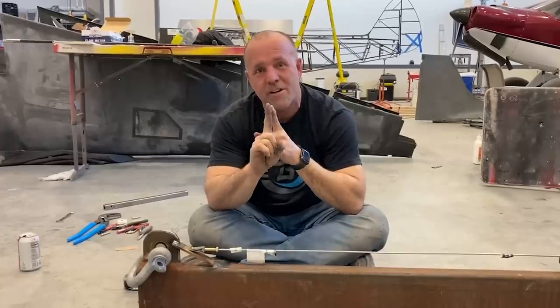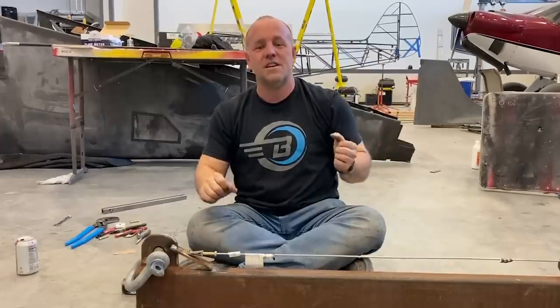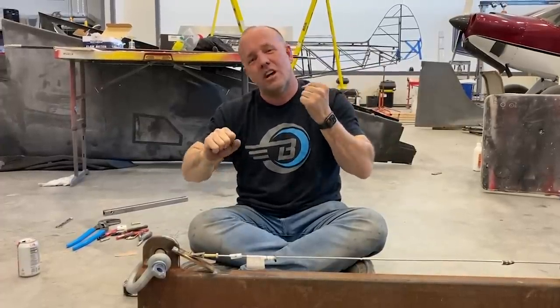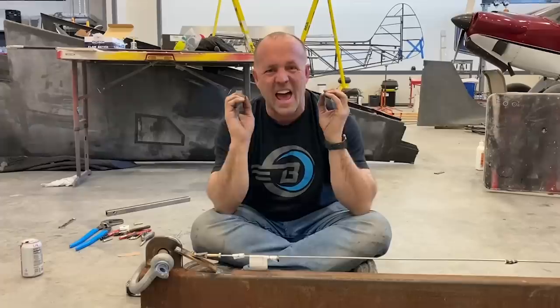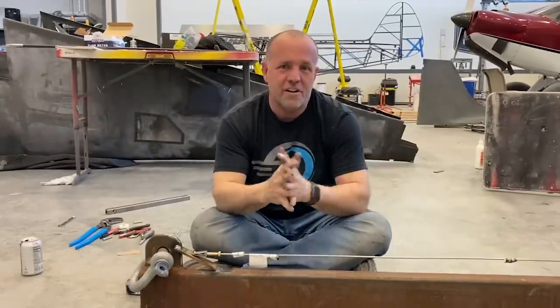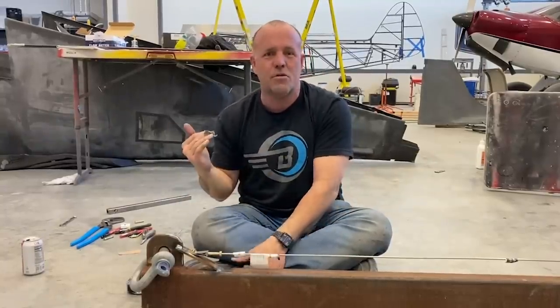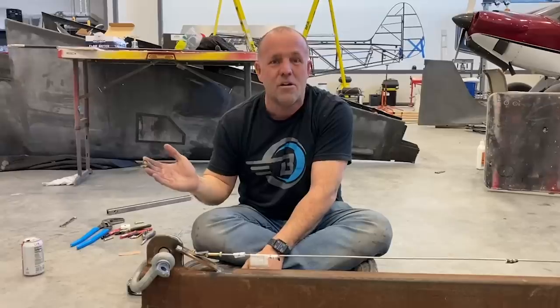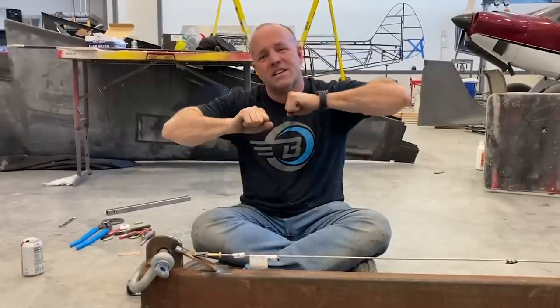And then the ultimate question, that's one failure. That's a small number of weight to get to that failure. The ultimate load failure is repeated movements, stretching and stretching and stretching, maybe one, maybe two, maybe all of the components have had first indication of failure, but haven't broken, haven't come apart. And that's the ultimate failure. We just stopped flying back at the first sign of first component failure. That's our number we're shooting for to find out if the carbon fiber part will hold up. I need to get to that or beyond. Then ultimately, when does it shatter apart?